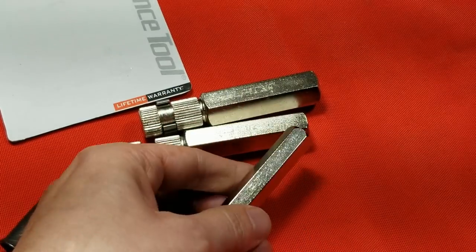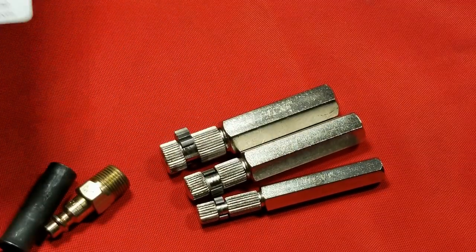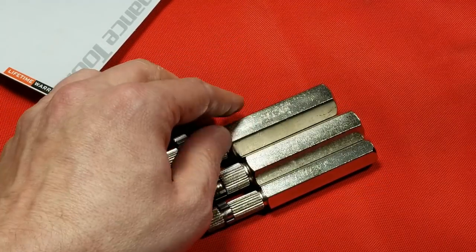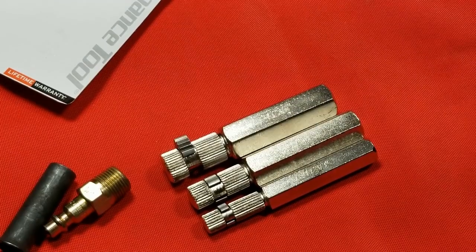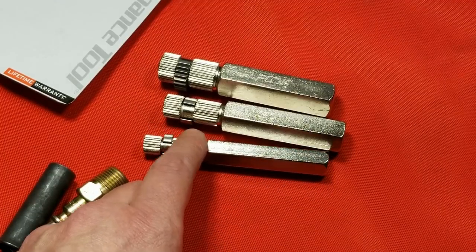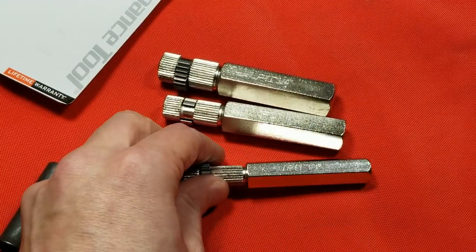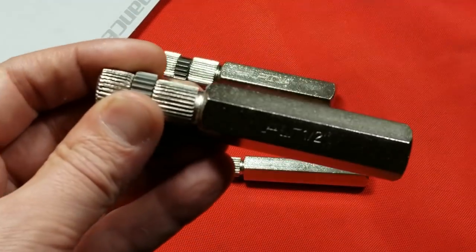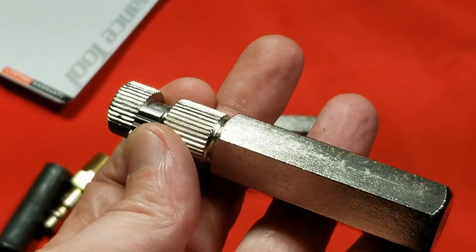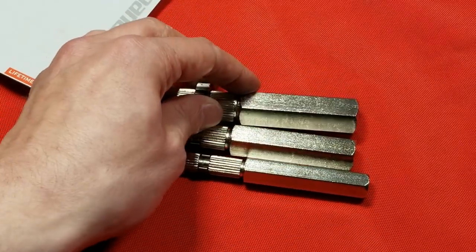So that's the other part of the deception — I found these from a Chinese manufacturer, made in China, and they were metric. They just ordered a bunch and asked if they could stamp fractional sizes onto them. The real deal is the three-eighths one works for tubing and pipe by internal diameter. The range of the three-eighths one is 450 to 550 thousandths — about 12 to 14 millimeters. The next size up works from about 9/16ths to 5/8ths, which is oddball, and then the largest would cover about 17mm through 19 or 20mm. Since 17mm is so close to three-quarters of an inch, you could just squeeze that one into the fitting at its minimum size.